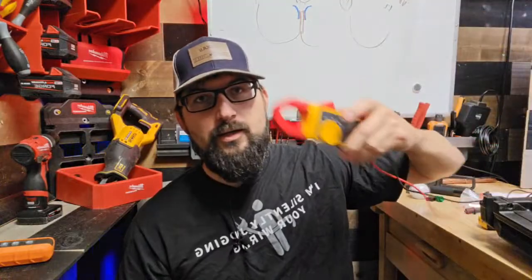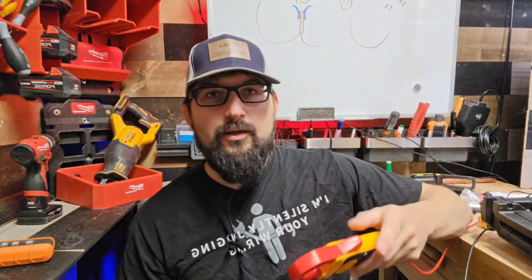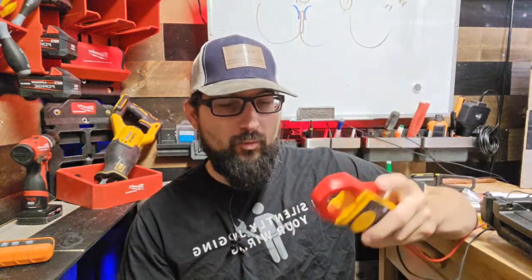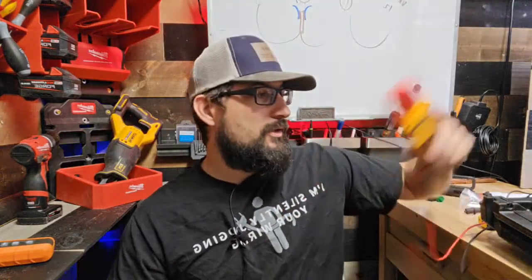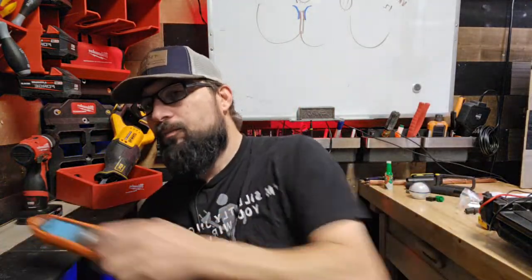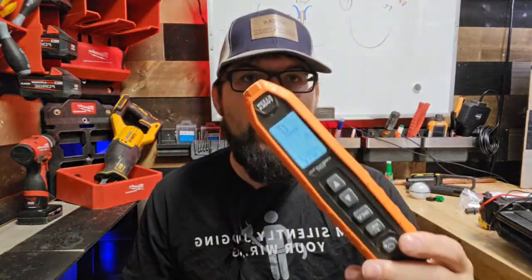So my thought is, if you're doing industrial and commercial work and you want to check voltage to protect your life, get a Fluke, get this meter. Get a T5, get a T6, something like that. If you're doing troubleshooting, get a good quality Fluke, and then also get a bang-around meter. One meter ain't gonna fix it all. Just like one toner versus one circuit tracer, it ain't gonna fix it all, because you still need to pinpoint wires. So back to the toners and tracers, this is not going to pinpoint wires.